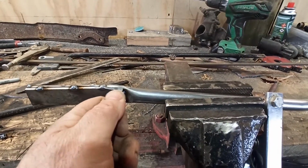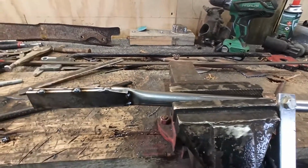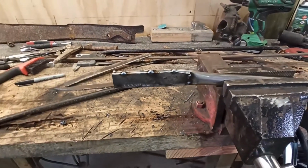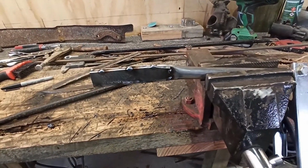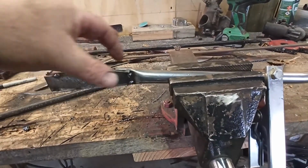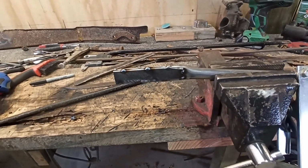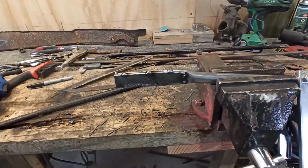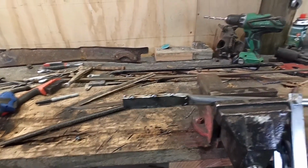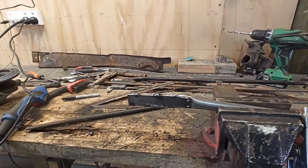When I weld, I'll weld back across this piece here so I can get a nice transition, and that should make that joint really strong across there. In theory, it'll be as strong as it's going to be, but that should really strengthen that up anyway, and it shouldn't flex around. So I'll get the camera set up, find another glove, whatever I've done with it. Oh, there it is. And get my helmet on and get this burned in.